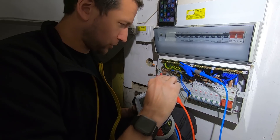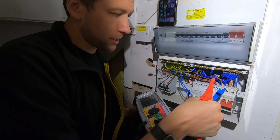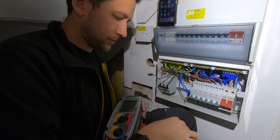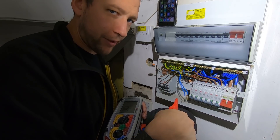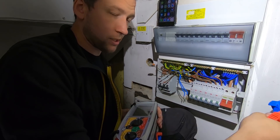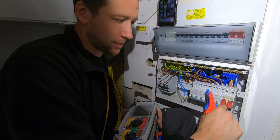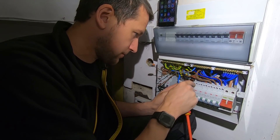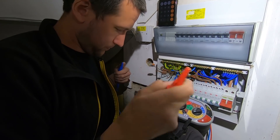One thing I want to say: once you've turned the main switch off, that terminal is still live obviously, but the rest of the board is dead. Once you turn the main switch off, leave all your breakers on and then just do a voltage test between live to earth and neutral - just to check you're not getting a back feed from somewhere. I've had that before. Just because you turn that switch off doesn't mean everything is dead. It's worth doing that quick test - it doesn't hurt to do it.